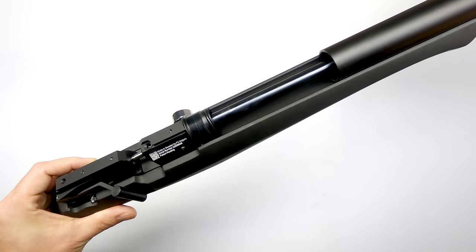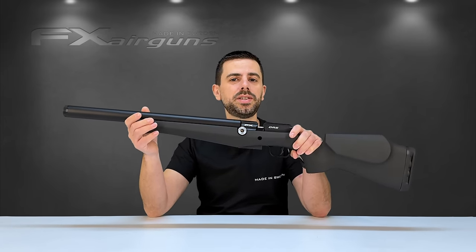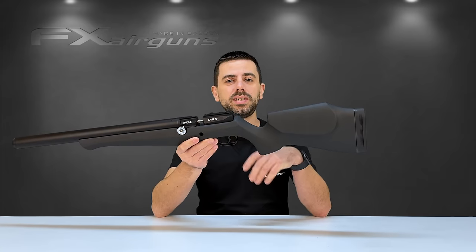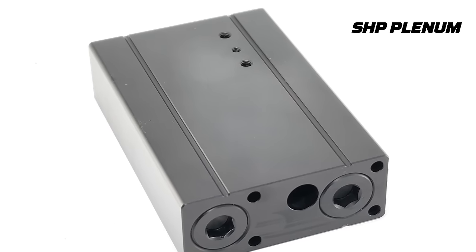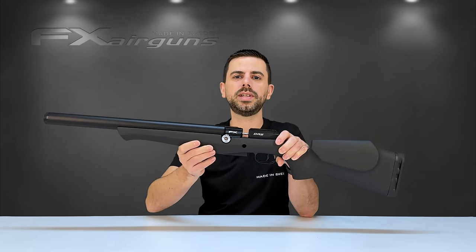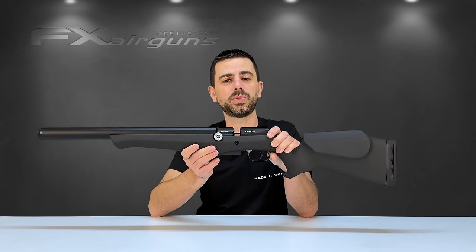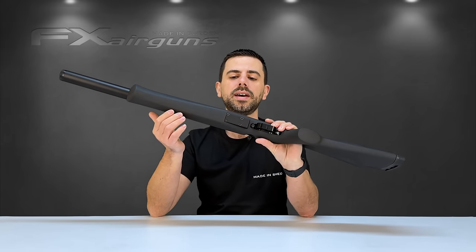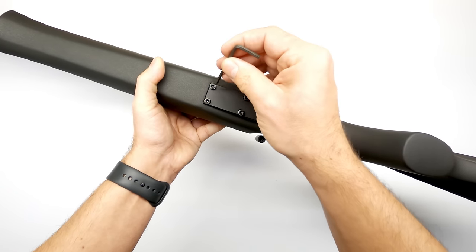By wrapping the air tank around the barrel and optimizing from back to front, there was no room for a traditional plenum, so it was cleverly engineered and disguised as one of the box magazines visible at the bottom. The plenums are available in two sizes: a high power one and a super high power one. The classic standard comes with the high power plenum, while the pro model comes with the super high power one — with some .25 caliber models also coming standard with the super high power version. The plenum is very easy to swap out with just four screws.